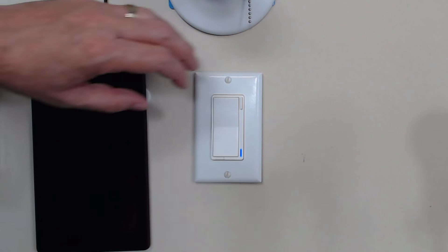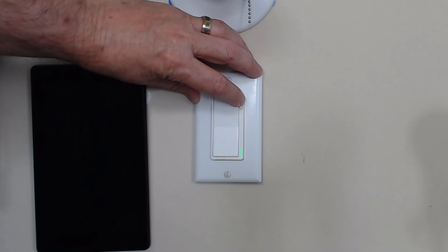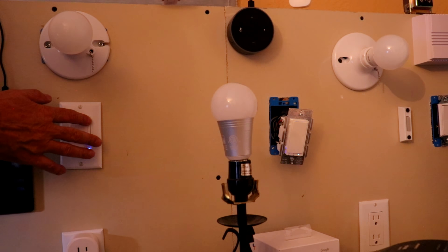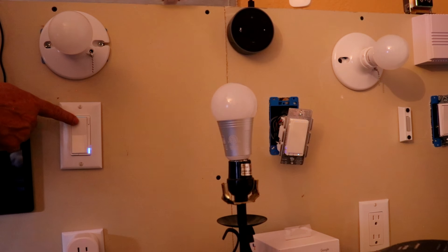While we're on the configure button, it's more than just a scene button. Hold the button down for somewhere between 5 and 10 seconds, and the LED turns into a signal strength indication. This is a great feature when you're trying to pair the switch — are you even in range of a proper Z-Wave signal? Well, now you'll know. And if you tap that same button eight times, it disables the internal relay — better stated, it disables manual control of the relay from the switch. Not sure why you need this? Well, that is the very subject of my very next video.